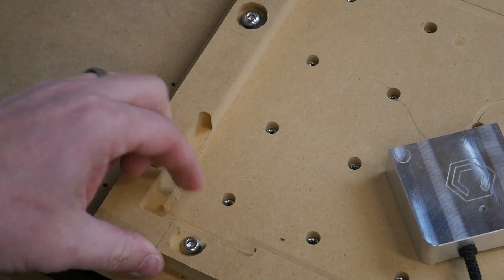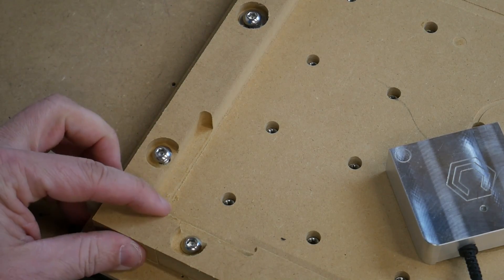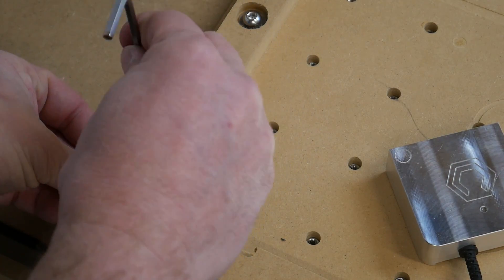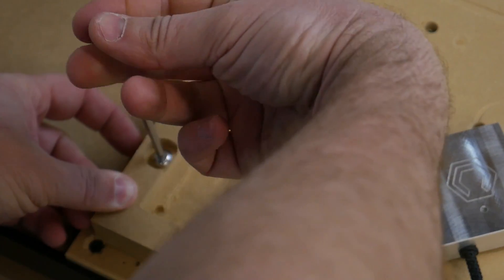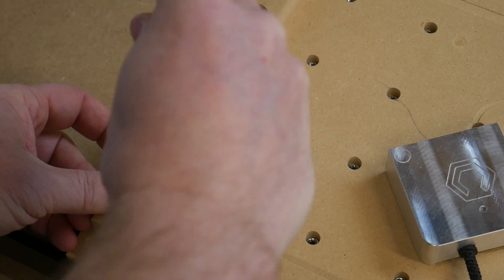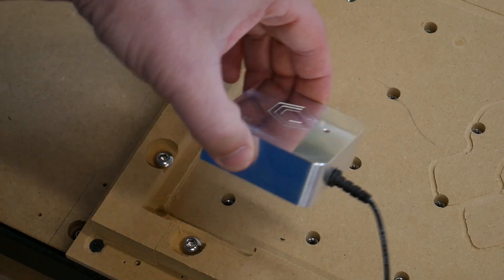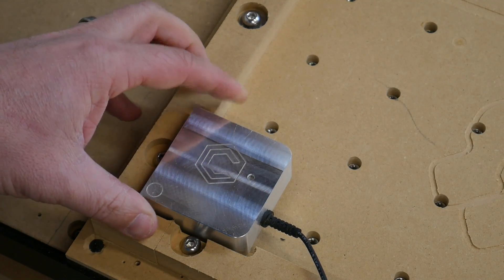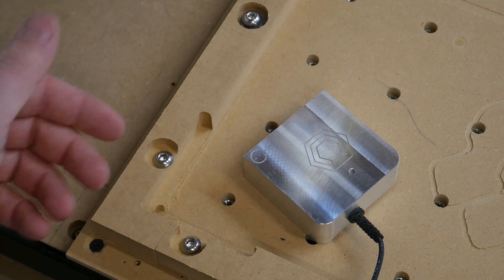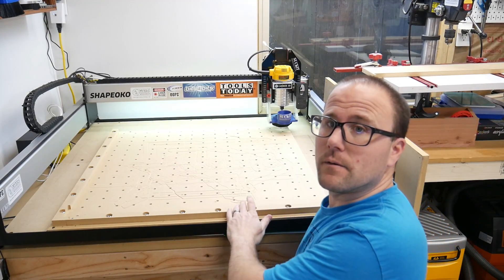Now you're going to take the same hardware that you used for your clamps and fill in all of these holes. There's a little play in it — I haven't tightened down this side yet; I'm trying to line this side up with the side up here as straight as it'll go. Once you have that, go ahead and tighten down the front bolt. You'll also notice in the front I didn't put the two washers up here because the washers will actually hit the plate. You could put them in, but you'd have to cut one side down.